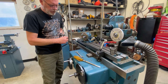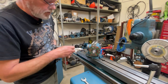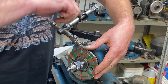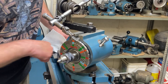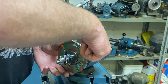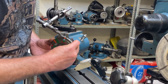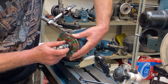I'm just putting together my little pointer here — it's a little spring-loaded pointer that'll run in these notches so I can index perfectly 180 degrees. I've got my pointer where I want it and now I want to loosen this off so that I can spin the spindle without spinning the indexing plate.